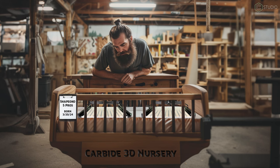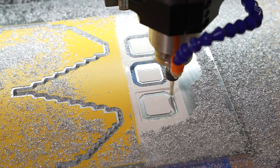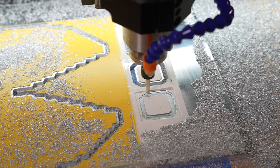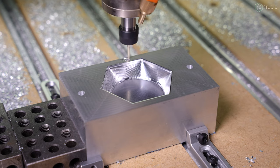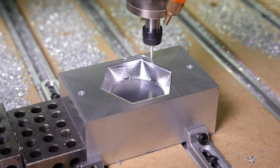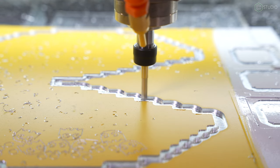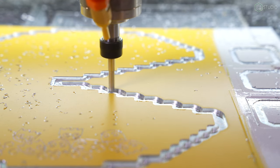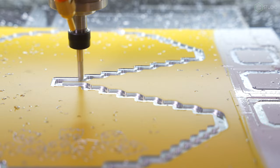Structurally, the spindles used in VFD systems are brushless — current is sent through wires on the inside of the can to generate spin of the magnetic armature, the reverse of a brushed motor. This construction makes the brushless spindle wildly more efficient, meaning less heat and much less noise. Additionally, spindles are capable of higher torque than a router, meaning the spindle will better maintain RPM velocity when cutting slots or going around interior corners, improving cut quality and potentially reducing end mill wear. A spindle is also made to a higher mechanical standard, resulting in less runout and more accurate machining, especially when cutting hardwoods and metals.